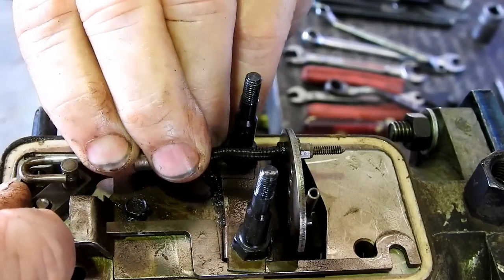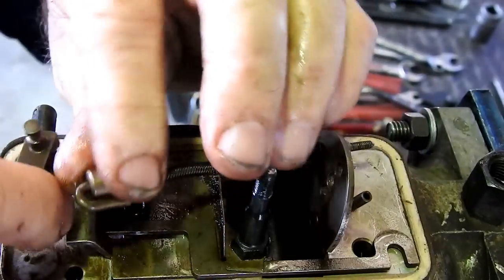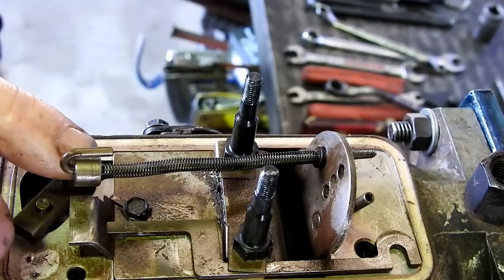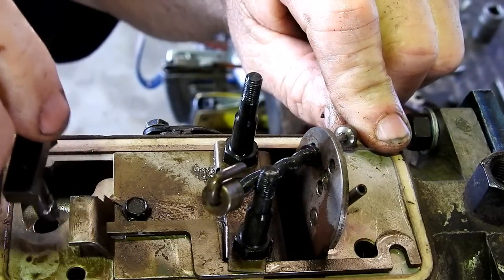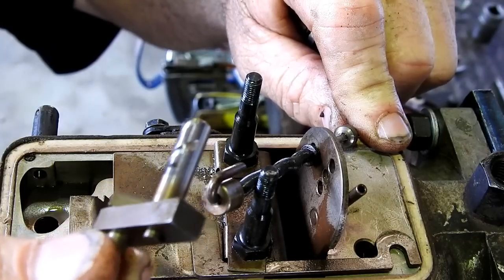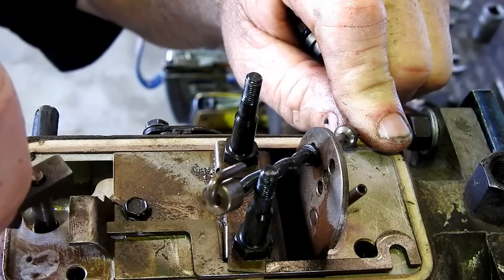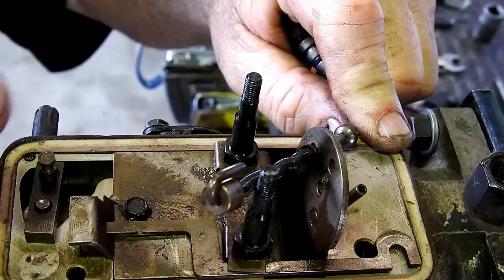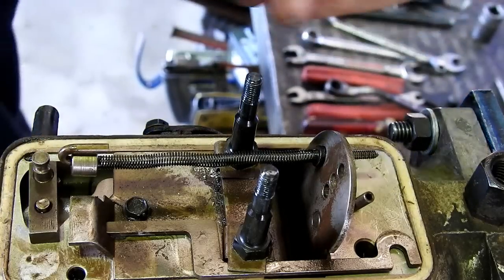Now, if you have a tractor that for no good reason at all was running and then all of a sudden wasn't running, it can well be that all you need to do is undo this. So what you have to look at is, you just get it out of the hole there. You can see the slots around it, and they decide how much fuel it gets. They line up with a port inside. And so yeah, if your tractor was running today and it wouldn't run tomorrow, that is really worth having a look. It's just pop the top off on the tractor. You don't have to pull it off the tractor and check your metering valve. So ours is nice and free.